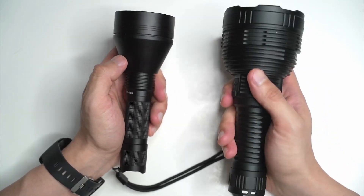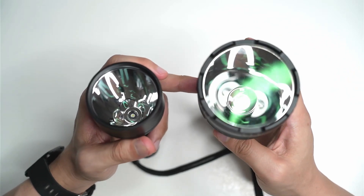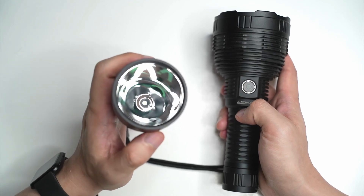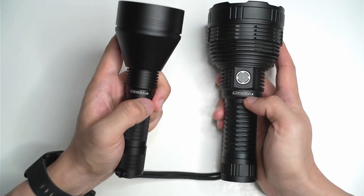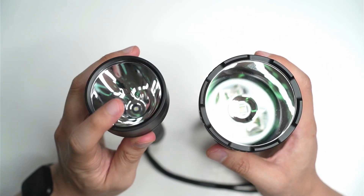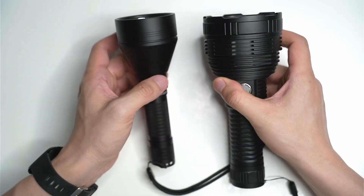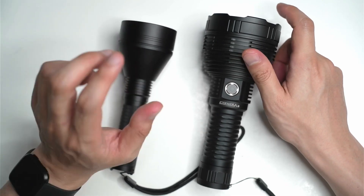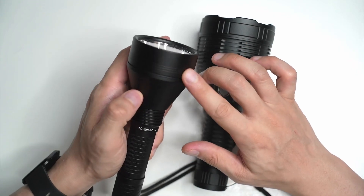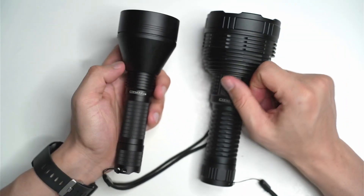In terms of performance, you're going to get a lot more lumens out of the L8 — probably more than double the lumen output of the L21B. It's just a larger emitter that produces more light in general. But when we come down to Candela rating — which is basically the range of the flashlight — the CSL PM1.F1 emitter actually out-throws the L8 by a hundred-plus meters, which is really impressive considering it's a smaller flashlight. I think it has to do with the miniaturization of the CSL PM1 emitter — it's very, very small but produces a lot of lumens for its size. The beam profiles are different too: the L8 has a much larger hotspot and more spill, whereas the L21B has a smaller hotspot and the L8 definitely produces a lot more spill.